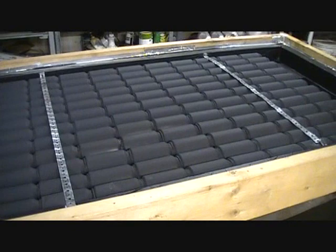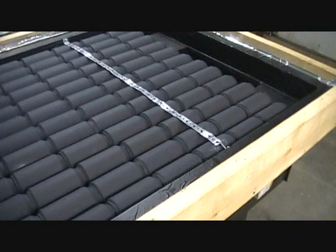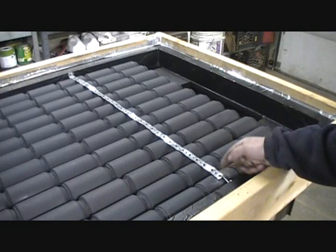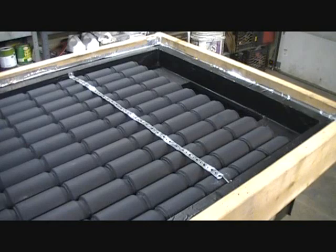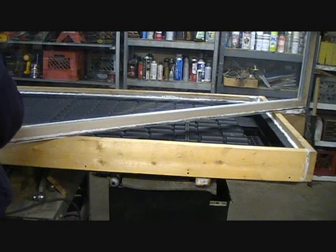So as you can see I've got my two braces in. The bottom is going to be caught by that lower lip. Up here you'll notice I ended up cutting the plumber's tape a little short, but in the interest of reusing things, I just used a longer screw, which is fine. These are not particularly tight — just tight enough to retain the cans and allow them to slide as they expand and contract. I've laid a pretty fat bead of caulk on the flat and the vertical. I'm also going to caulk the edge once the window's in. It would be really handy if I had another set of hands, but I don't, so it's going to go as it goes.